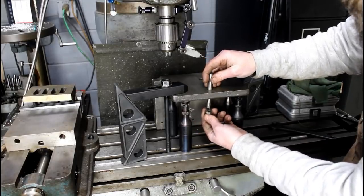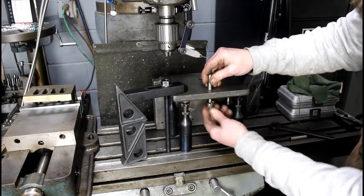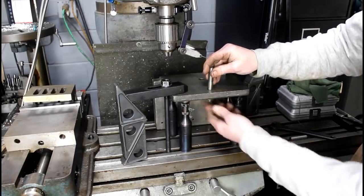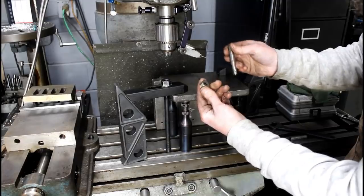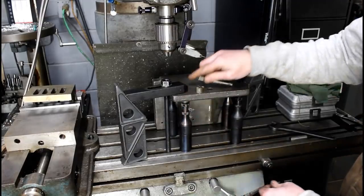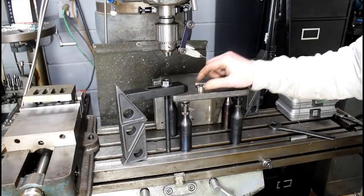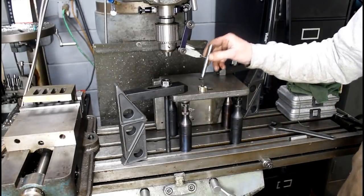This is the actual cutter head, which locks onto the shank with a cam action. Then it'll be pulled up into the pocket, and it should machine the seat square to the sides. That's the idea anyway. Now this is shop made, but you can get those commercially, but they're really size specific. So let me get squared up over one of these holes. I'll bring it in, show you the tool a little better, and then we'll cut these two pockets.